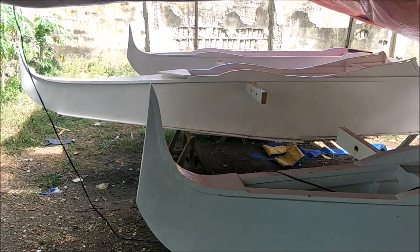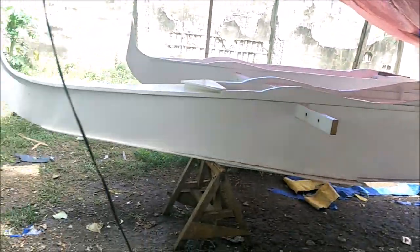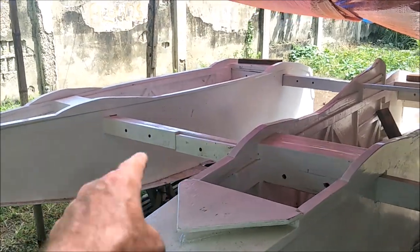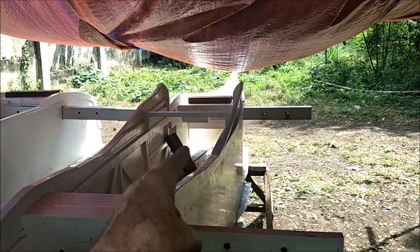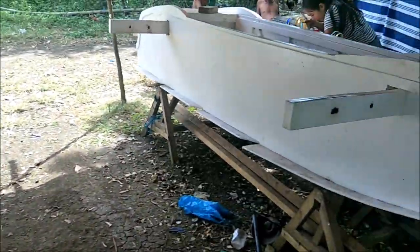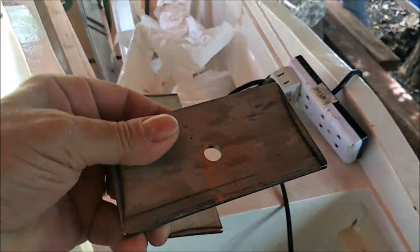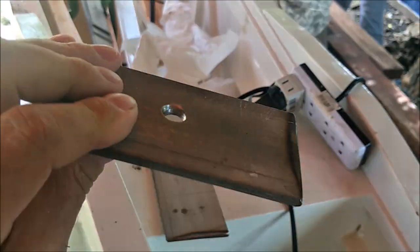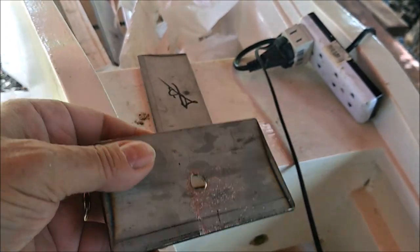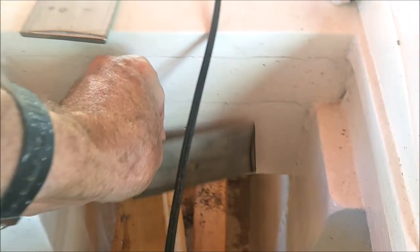Hey everybody, we have got all of our cross brace big pieces done. All the stainless steel, all the mahogany wood and all that, everything's drilled out. We still need to epoxy the little green inserts in these things here. And right now we're drilling these little guys here, and man, this stuff is a bear to drill through. This 316 stainless just tears up a cobalt drill bit. You can drill just a few holes and the bit's dull. But yeah, this piece here goes on this side, see, like there where the bolt goes through.